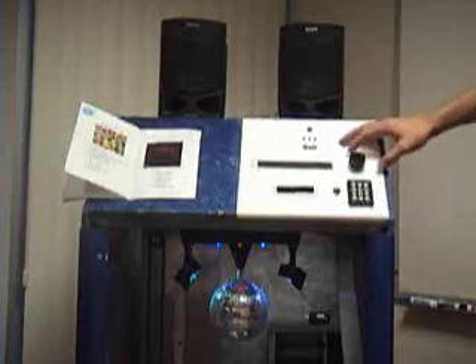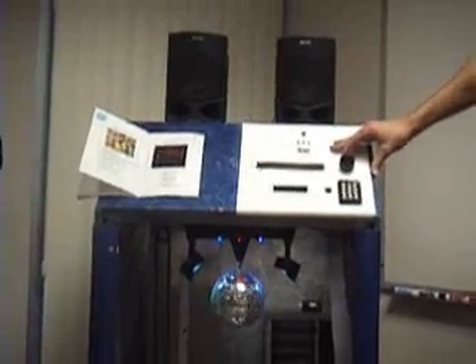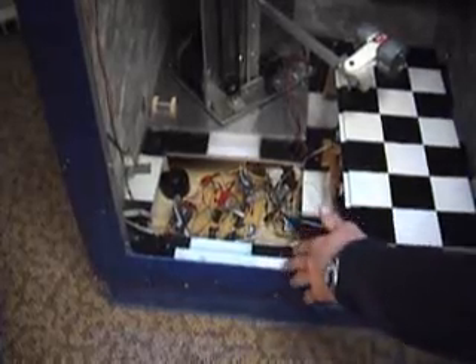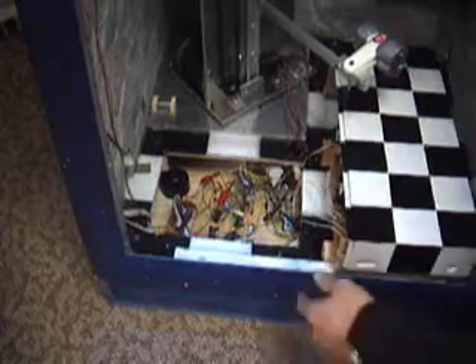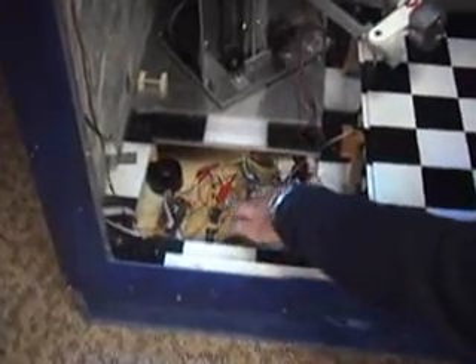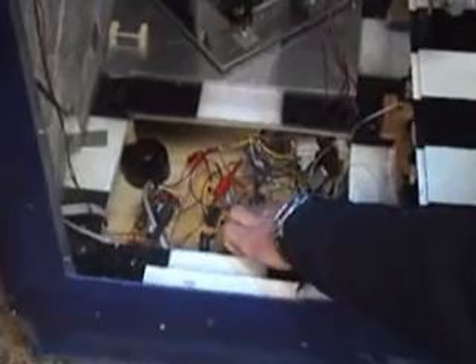Perfect summer song. Primarily, the LCD and the user interface are driven off the keypad. Both of those integrate into an EDE-1144 and an EDE-702. They communicate serially with what we call the main PIC, which handles most of the organization of all the functions. It communicates with the sensor PIC above.